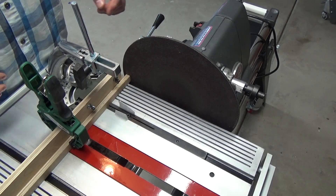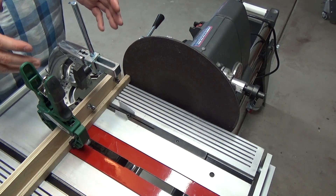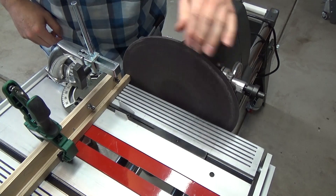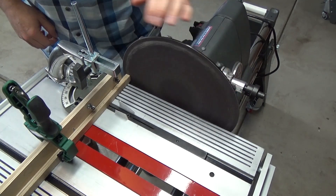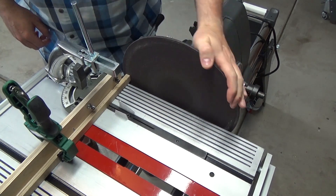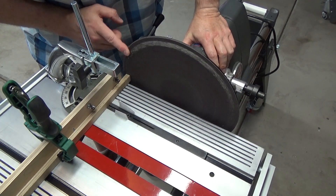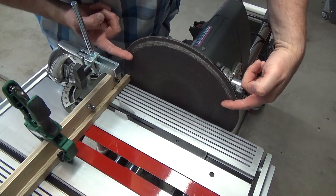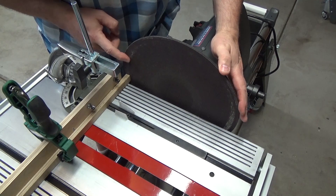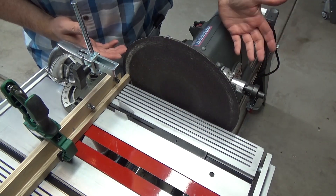Let me illustrate in slow speed what was happening with the 12 inch disc sander that prompted me to measure the run out on the quill. You can see that the wood is touching only in about one third of the disc — this whole half of the disc isn't collecting any abrasive.